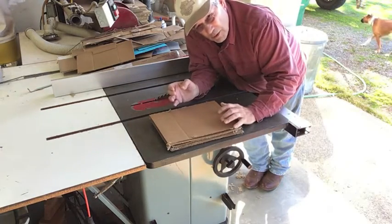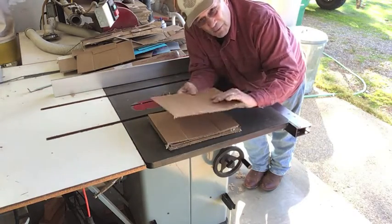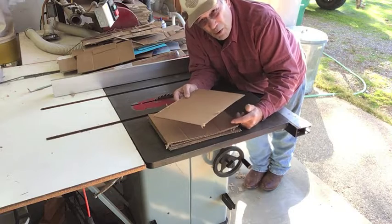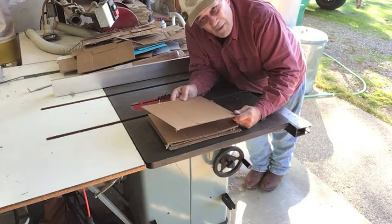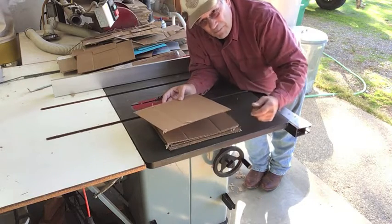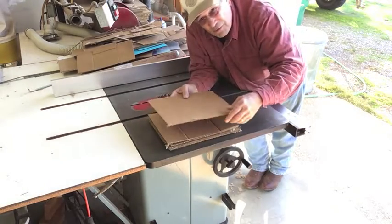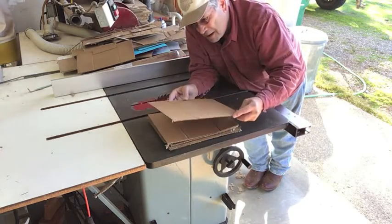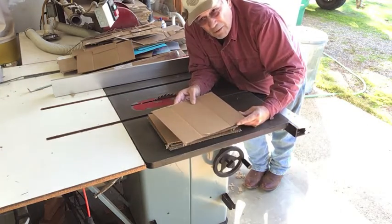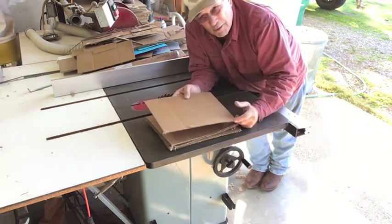Or it ain't cardboard, it's corrugated board. I used to wire all the machines that made this type of stuff. The machine that makes this right here is 300 feet long, 20 feet high, about 25 feet wide. Takes about 8 or 10 men to run it, from feeding paper rolls on one end and then managing all the process in the middle and then taking the stacks off the other end. Takes a steam boiler, compressed air, and a whole lot of electricity. That's where my part came in, and a whole lot of motor control.